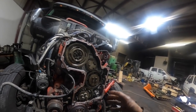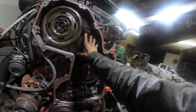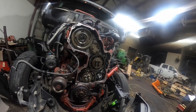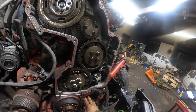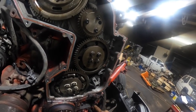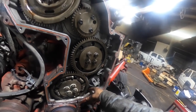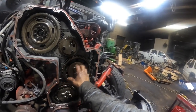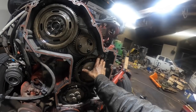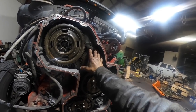I was trying to explain to him, and then we were putting all this together, and this upper, or the camshaft adjustable idler gear, and we set the backlash, so I'll go over that with you. So on this particular engine, some of these engines had an adjustable fuel pump idler gear, and then the older engines, a lot of them had this gear here adjustable, okay, but this one's not. This one's the adjustable gear here, this camshaft idler adjustable gear.